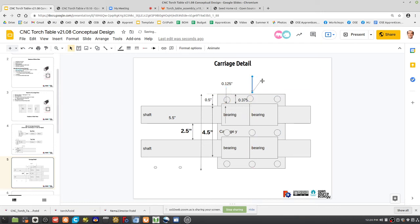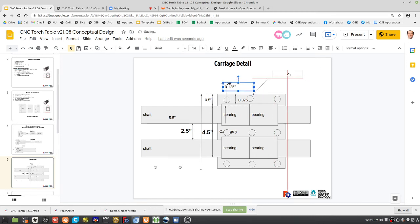Now, there's a thing called rapid prototyping. We can test some of these things out, do a simple box, or maybe a strip like this. See if the bearing fits in there, what exactly the bearing size should be. You can do a small cut of this and just print it out to prototype. Do the bearings fit? Are the bolts threading in properly? Things like that. That would be called test-driven design, partial prototyping using 3D printing.